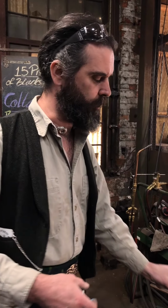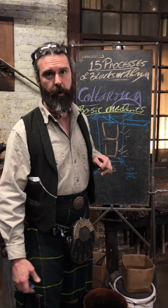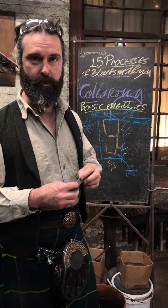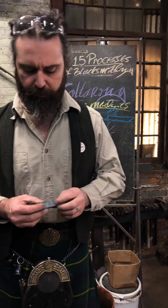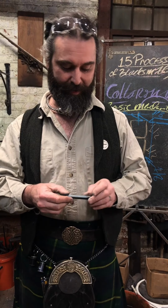If I was going for thicker material, obviously I'd change that. So if I was collaring with, say, 1/2 inch material, each corner would be an addition of 1/4 inch. So I'd actually add an extra inch to the collar. But in this particular situation, that'd be quite ridiculous. If you wanted to be really fancy and build up square corners on your collars and all those kinds of things, you got a whole other situation to go ahead of, and I'm going to leave you to do the math on that yourself.